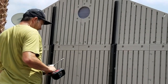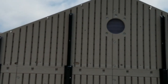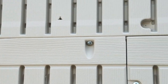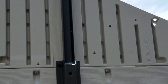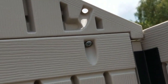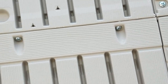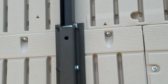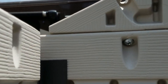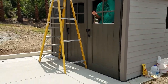Those holes should all line up — the more perfectly the holes line up, the better. You can see a nice flat smooth section there. Then you can tighten the screws into the holes that run along the gable channel. Snug them all up and you're all set. There are your corner brackets that hold your corner together — on the inside view all these screws you can go through and snug up. Set your torque on your drill to medium or low so you don't pop them all the way through. There's your left side — as you can see it's straight. And on the other side there's a little block that drops into place which has already been lined up perfectly.